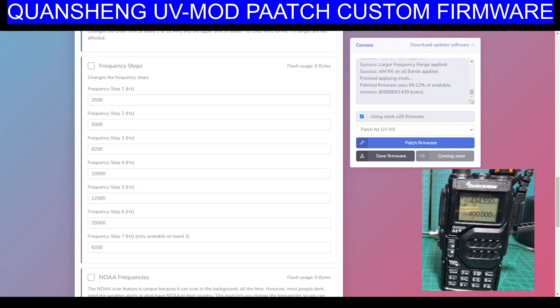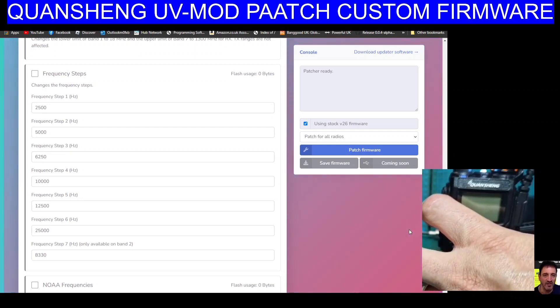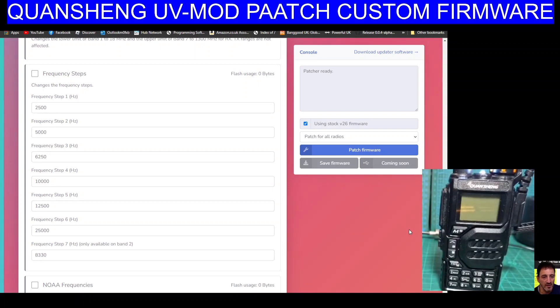Click here to see if we can find the update tool. We'll put the radio in firmware mode by turning it off, holding down the PTT and turning it on. The torch will light up. Then double-click the updater file. We need to select the COM port — right click, device manager. It's a UV5R cable by the way, coming up as COM 11. Then we go to 11 and connect. We need to select the firmware we just made, which is mod number one, and hit this button. It will send that to our device — you can now see it doing that.